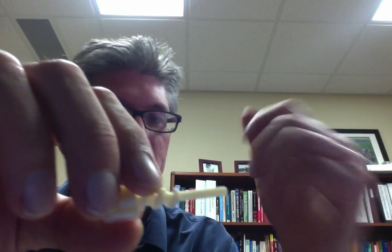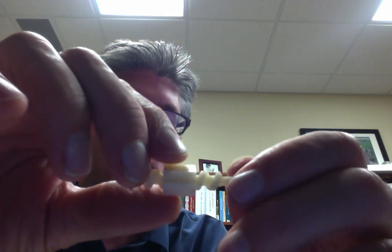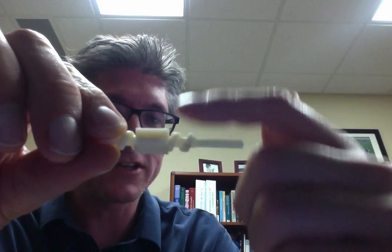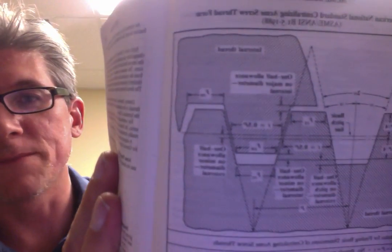The important thing is that the clearance — the clearance diametrically — is 20 thou. So I kept it at 20 thou. And you can see here, basically, that's the clearance we're talking about there — 20 thou diametrically, both on the crown and the bottom.